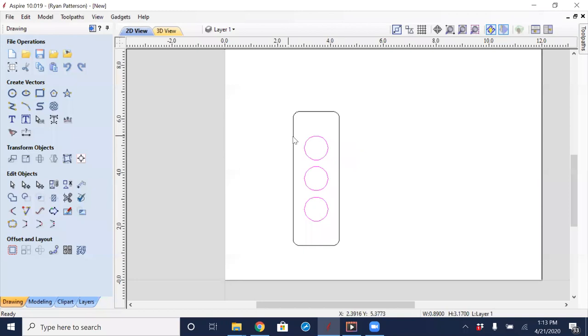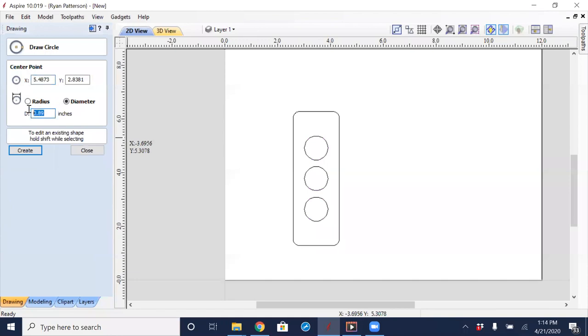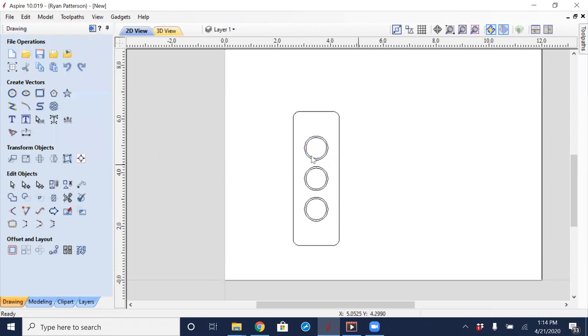This 0.89" circle is the exact outer diameter of the switch — it has a little flange that presses in and fits. The inner section circle is 0.78 inches, so I need to draw circles at that size from the centers. I'm going to draw a circle, changing the diameter to 0.78 before drawing. That way, every time I snap to the center of each outer circle and click, it gives me that circle at the selected size. The three inner circles are what I'll be using for the toolpath selection.